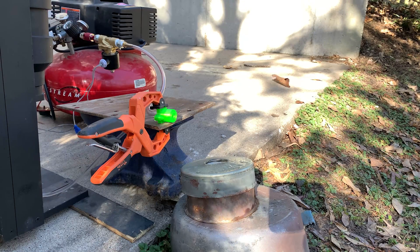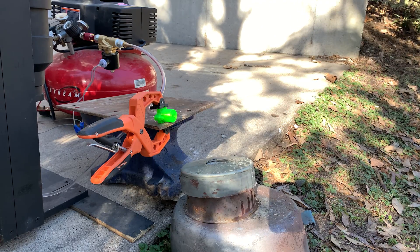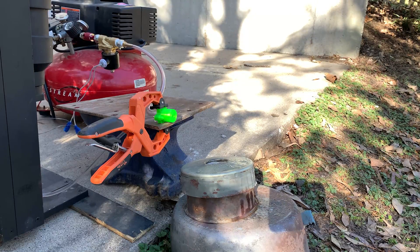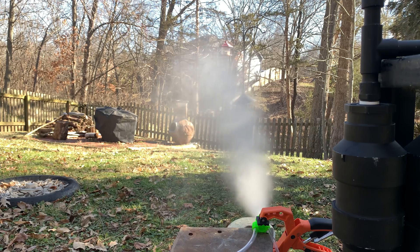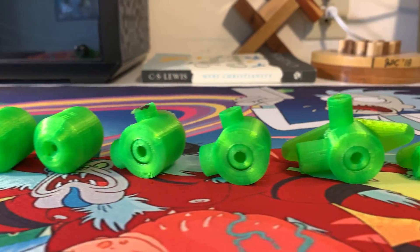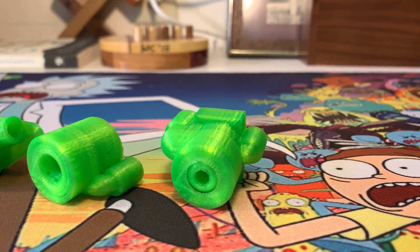With no airflow, you can see just how consistent and symmetrical the fuel flow is being spun out of the nozzle. And when airflow is added back in, you can see how tiny the droplets are that are being produced. After hours of research and design, and about 11 different prototypes, I finally had an injector that I was happy with, and all that was left to do with it was to test it.